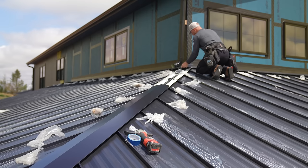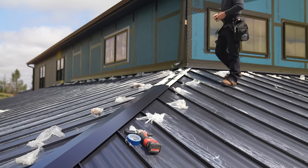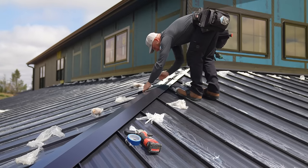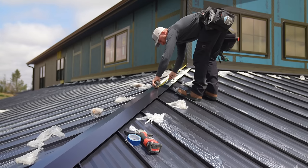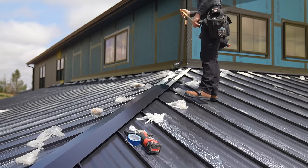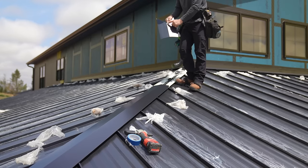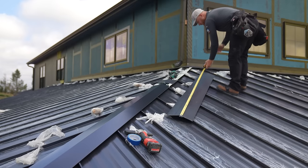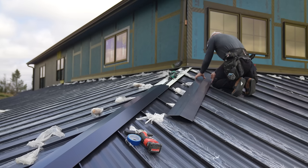Now I have my template and I can set it on here and verify it's a nice clean cut, so I know that's going to be good. What that allows me to do is come down here where I made those notches, put a mark on the center, give myself a couple of light scribe lines, and measure from the peak up here to that mark — that is 87 and 9/16ths. Now I can take this template, measure 87 and 9/16ths on my trim, set my template at 87 and 9/16ths from the finished edge, and that should be where I'm going to bend up this flashing so that it goes up the wall ever so slightly.